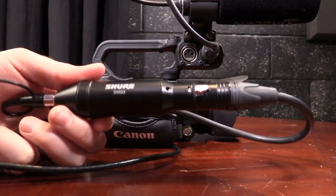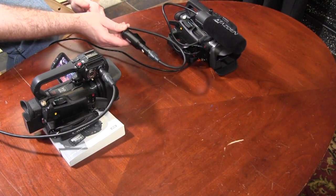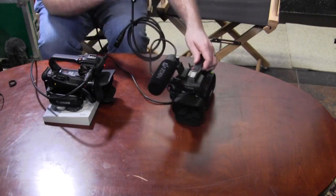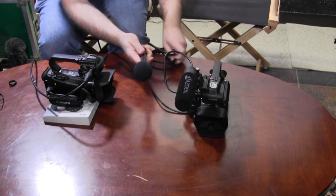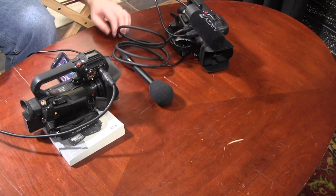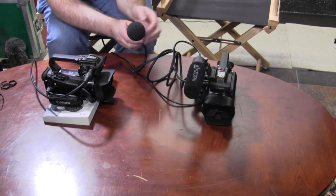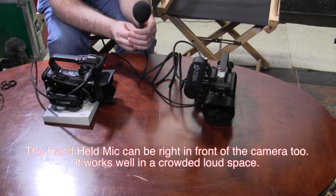Let's go through our scenarios. You can plug in two lavalier microphones into the inputs, which allows you to do a sit-down interview where two people are miked. The second scenario is you're out doing an ENG — set up your shotgun microphone and connect your handheld microphone to channel two input. This gives you two audio inputs. The pickup pattern of the shotgun mic picks up what's directly in front of it, while the handheld mic lets you be off-axis from the camera and still pick up your voice clearly.